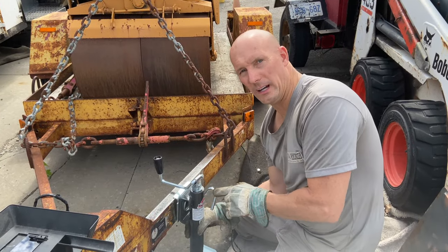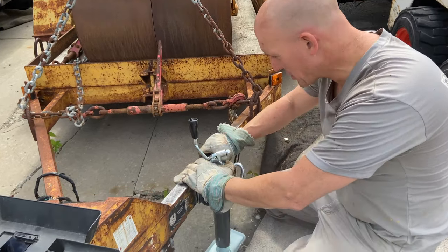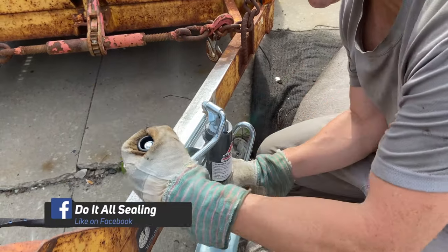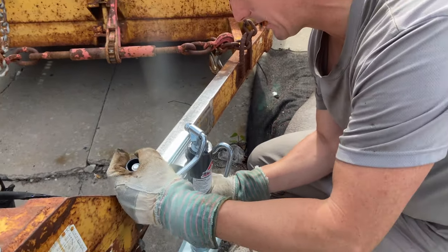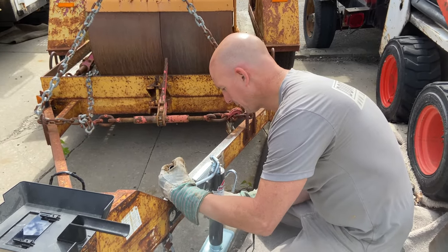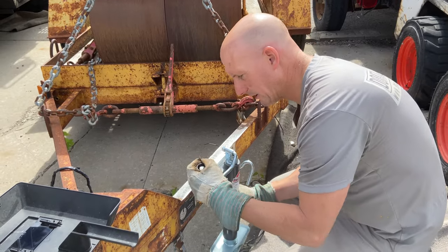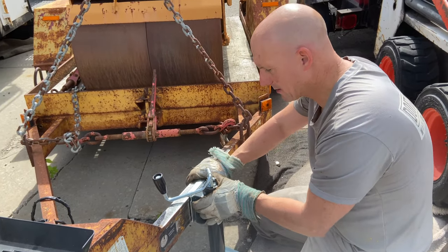Before welding I want to have the correct position because I won't be able to change it after. I have the jack up in place, keeping in mind that when this turns I want it to have clearance, and I also want to have free motion of the handle. If it's too far over it's going to be too hard to crank the jack. I want enough clearance for the foot and the handle. This seems to be about the right place, so this is where I'm going to install it.